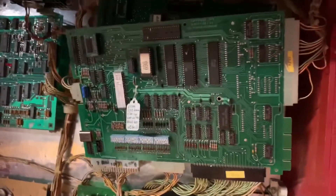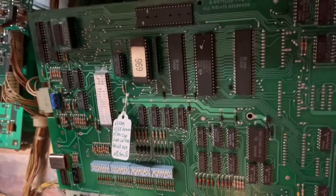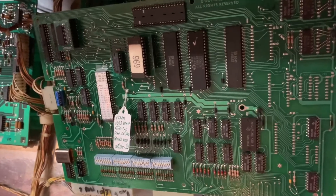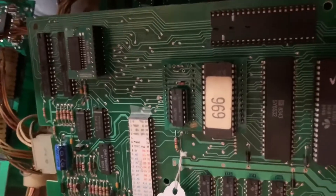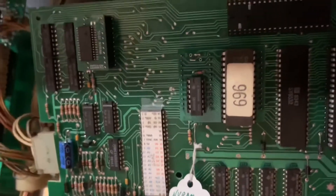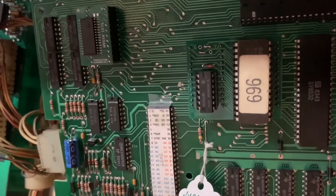The Chicago Cubs are here in St. Louis and we will tolerate them for a little while. This is an MPU board sent in to me for rehab. It had problems with the daughter card, as so many of these games of this vintage do. I like to replace it with the re-engineered daughter card from Ed at Great Plains Electronics.